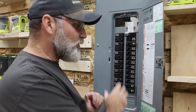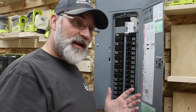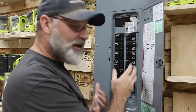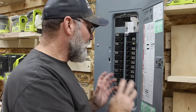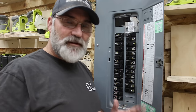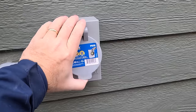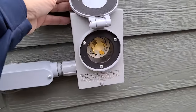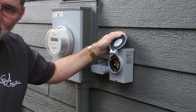You want to turn these breakers on individually until the house is completely powered up. If for some reason you get to an overload condition, you'll know what the extent and the limit is. Personally, I would turn on the kitchen appliances first, then the water heater, the furnace, and stuff like that — maybe leave some of the bedrooms off if necessary. My generator is big enough to power my whole house. Here's my meter box, and my electrician has put in this 240-volt twist connector that goes from a cable to my generator.